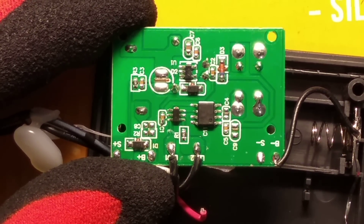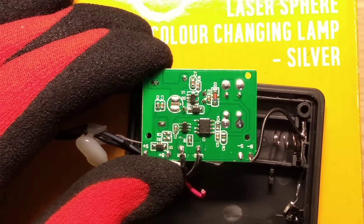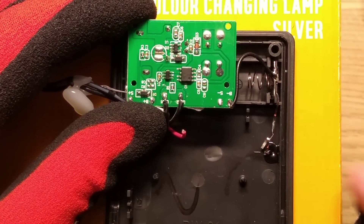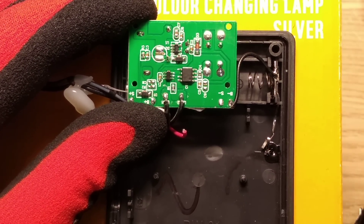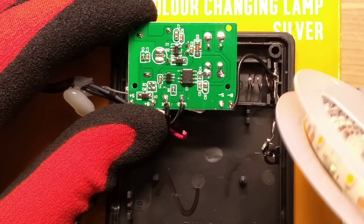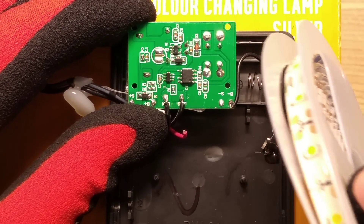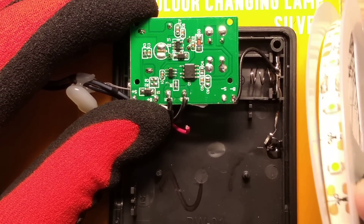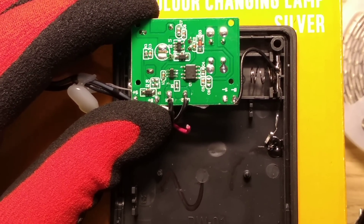That's about all there is to say. The fact that it's got circuitry like that does kind of limit its versatility - it means you're always going to have those two circuits. It would have been nice if it had just had the option of turning the LEDs on at a fairly decent brightness, because it would be nice if this LED tape could be run directly from DC like USB-powered stuff. But it's the alternating polarity approach, which does allow those other effects.